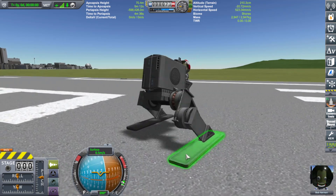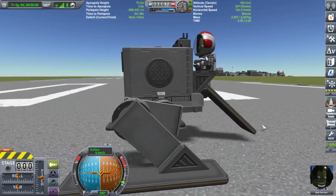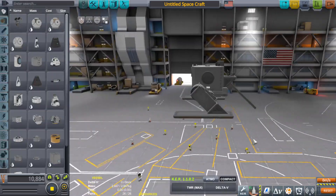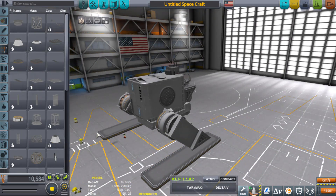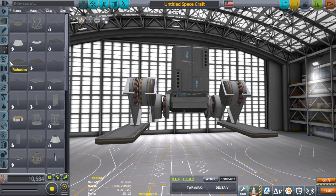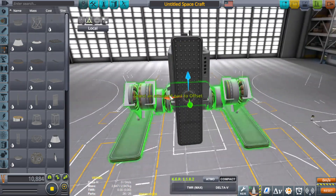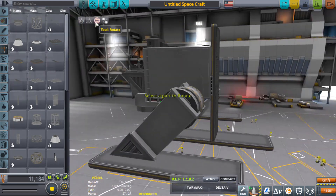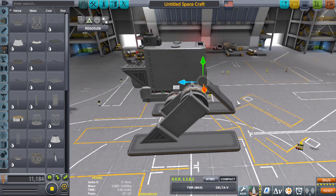The way I reset it: I made it so that one key turned on all the motors, and once all the motors were activated, a second key toggled the brakes between the front-left and back-right foot so those feet could be controlled separately. That allowed the first set of feet to lift the vehicle while I released the brakes, and then the second pair of feet could move in tandem with the other two, allowing a walking-type motion.